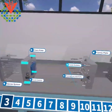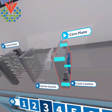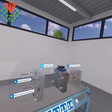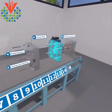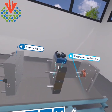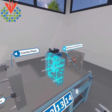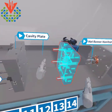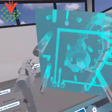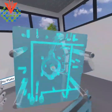The purpose of guide bushings is to guide the stationary and movable mold halves. I can stop the audio and grab certain sections within our system. The hot runner manifold plate contains the hot runner drop, cable channels for the heaters, and water circuits for cooling. I can stop it anytime and just grab the plate and look inside how this mold was designed, with all the holes, pockets, and channels.